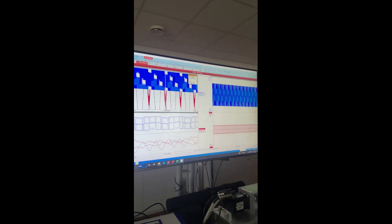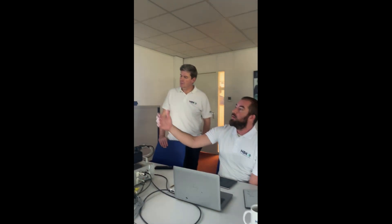So if you have that vibration — that frequency in your current — that makes its way to frequency in your torque. So as a customer, what am I doing with that? Am I going back to my design team and saying the unit's too coggy or too ripply? Well yeah — you can go back to the motor design team and fine-tune the model. A lot of it comes down to the winding function, but you can also go to the control team and change the DQ currents. Torque ripple cancellation is basically active noise cancellation in headphones.